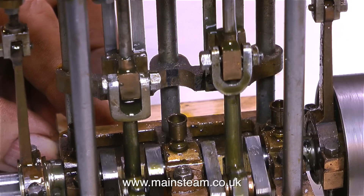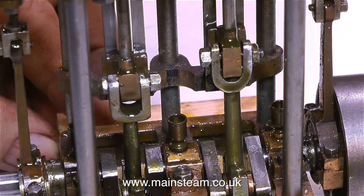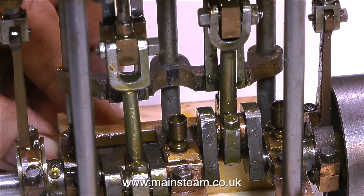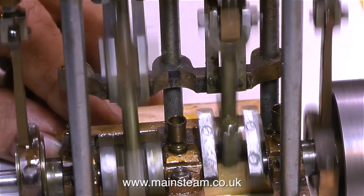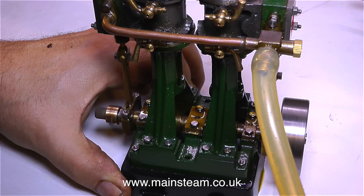Before any Inspector Meticulous-type experts write in and tell me I'm doing it wrong — I do know about the fix whereby you can get a compound to be self-starting by making a special valve that does two things: it exhausts the outlet of cylinder 1 to the atmosphere, and then supplies live steam from the boiler to the inlet of cylinder 2. Then when you close the valve, the engine goes from being a simple engine to a compound engine again. So it's self-starting as a simple, and will then run as a compound just by moving the lever on the valve — which is all very well, but a little bit beyond the scope of what I need to do with this boat. The radio control system will include, of course, a gas shut-off valve, just in case the engine does stop.